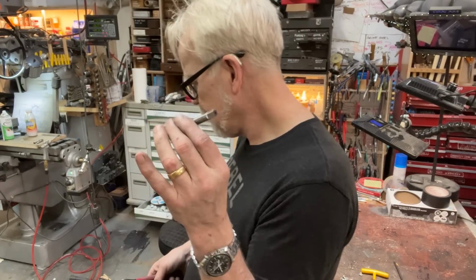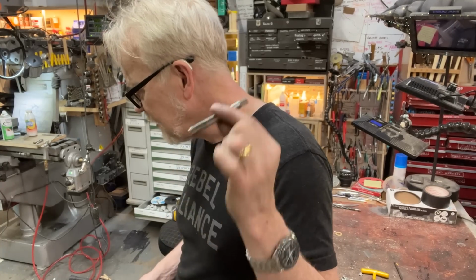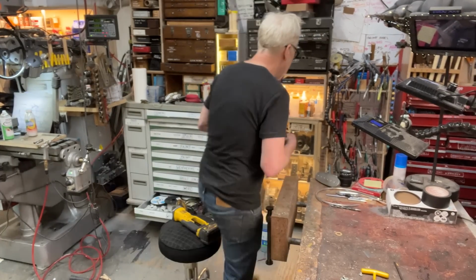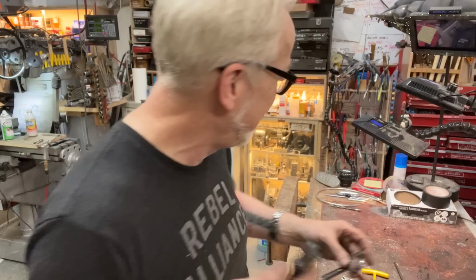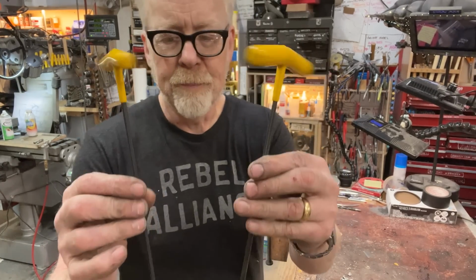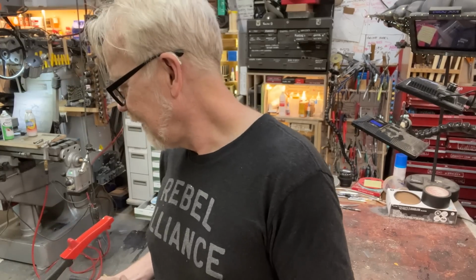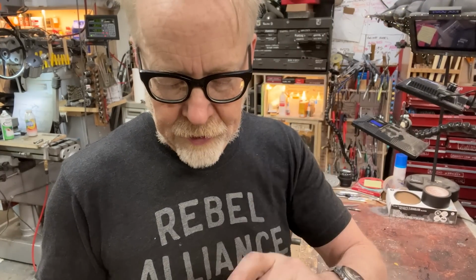1/2-inch 13. Yeah, this was a tap I used to help clean out one of the holes holding this whole thing down. Crescent wrenches. Do I need to explain? Oh, I will. You don't have to feel dumb if you don't know. These are for nuts and for bolts, for hex-headed bolts. The Allens, nice couple. My Bondhus Allens for all the Allen needs, and my rivets and rivet gun. I used a bunch of rivets in this one, holding some of the stuff together. The rivets I used were all aluminum body rivets, 1/8 inch.